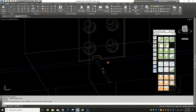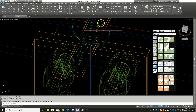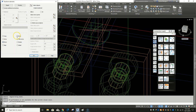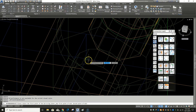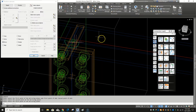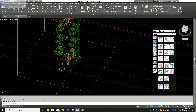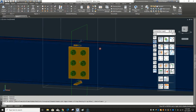We want to move that down to the bottom side, so we can delete that one. Select this feature and go to Tools palette — Advanced Copy — select Mirror, 3D Mirror, pick mirror points. I usually pick the outer extremities of one side — the outside there and here — to create a plane in the center of the beam, giving it a point in the Z and X axes. Preview that and you can see it's there at the bottom. There's your weld preparation. Turn on the shader and you can see what you've got.